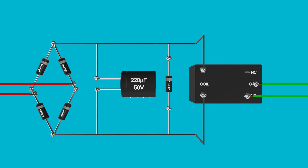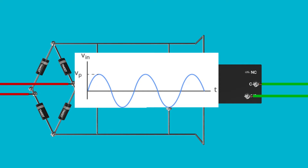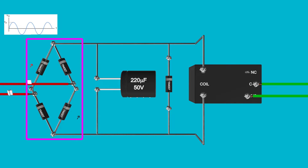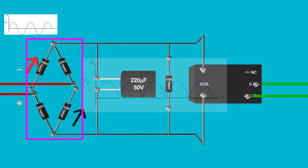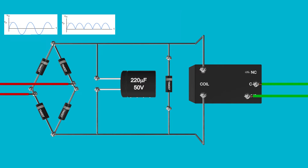So what's going on here? The voltage from the transformer comes in on the red wires. Most transformers for your garden actually produce AC current, so it alternates back and forth between positive and negative. Since alternating current isn't particularly good for DC relays, the first four diodes act as a rectifier, taking all the negative bumps and making them positive too. Unfortunately, we still drop to zero volts between each bump, and the relay is probably not going to like that — it might start buzzing loudly.